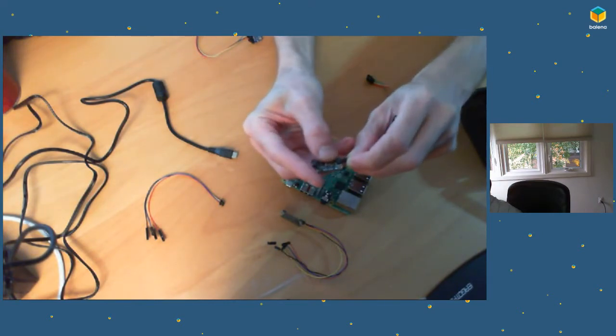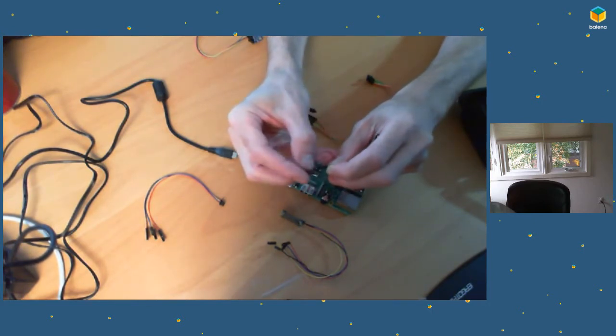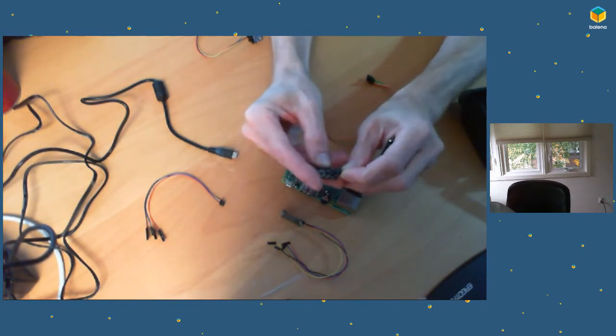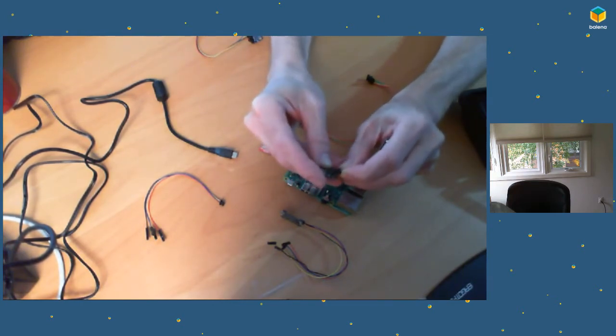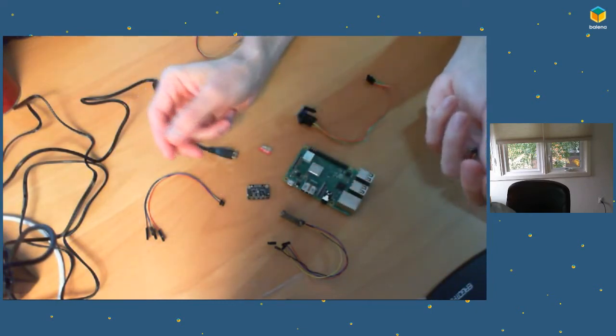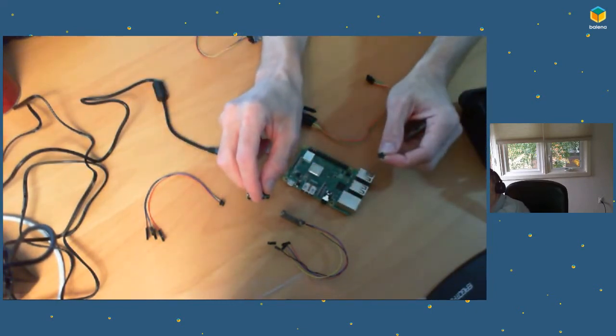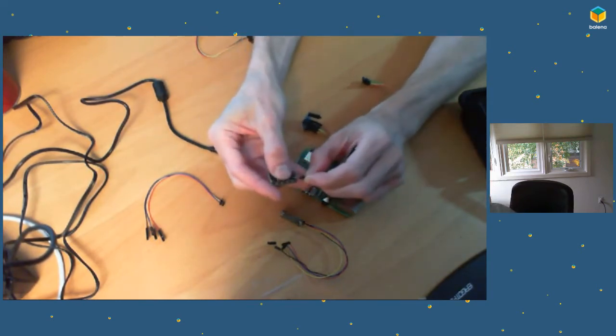and when I say I2C address, what I am referring to is the fact that every I2C sensor that's connected to the I2C bus on the computer has its own unique address, and that's how you know which device you're getting the data from.